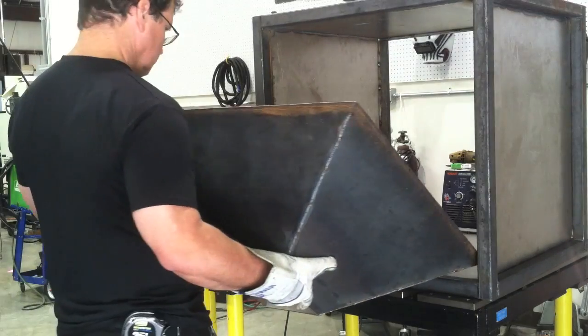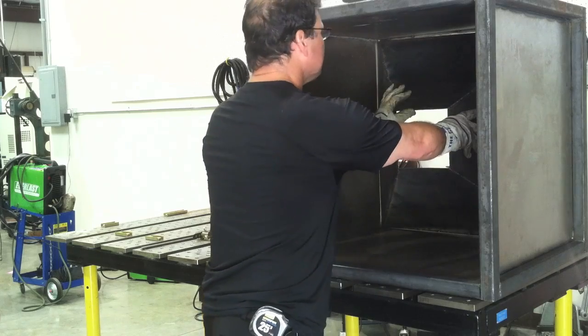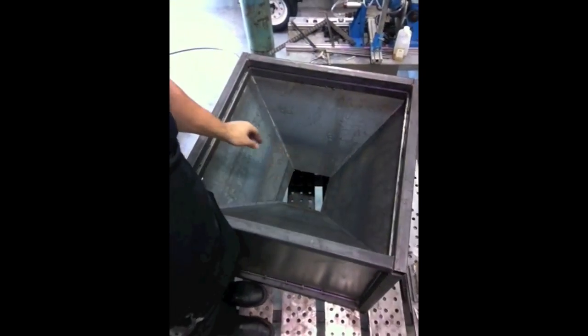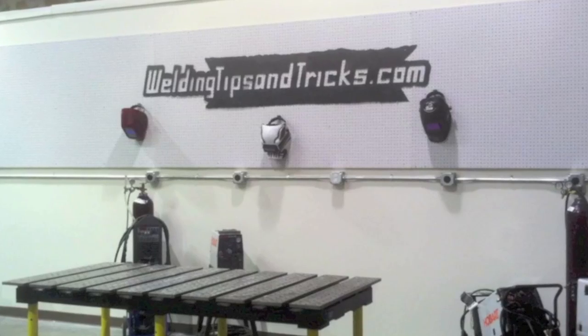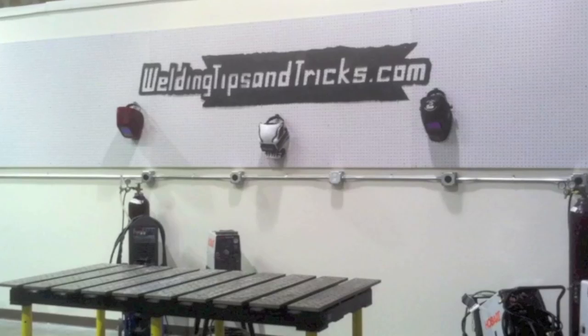It's mostly a full-penetration weld and let's see if it fits — and it does. There's a little daylight up in there but that's a lot easier than trying to beat it in. I'm going to use a piece of flat bar trimmed around the edge, and from the top view that's going to direct all the sparks and dross down into the sliding tray, which will dump when it gets about halfway full. That's part one — there are going to be several parts to this video. I'm going to show all the mistakes and things I wish I'd done differently. Stay tuned and thanks for watching WeldingTipsAndTricks.com.